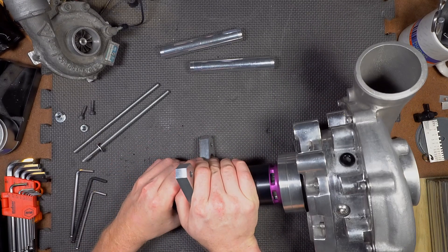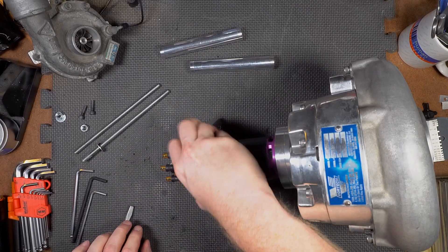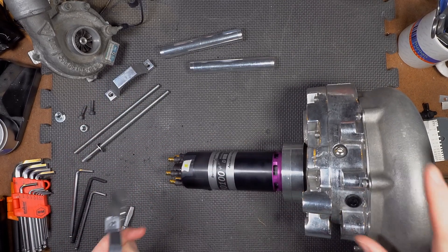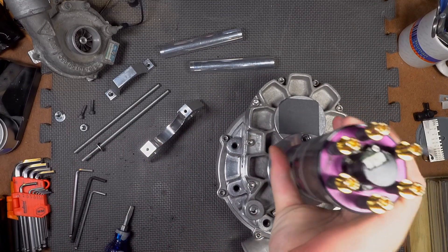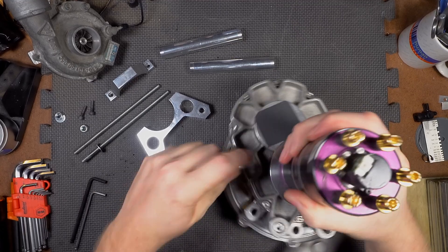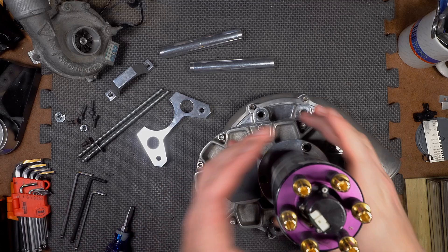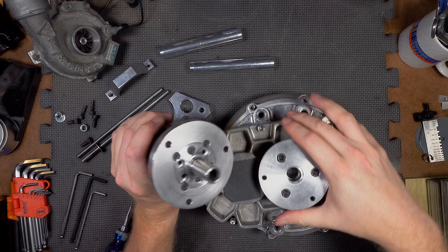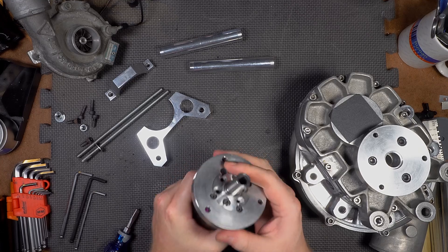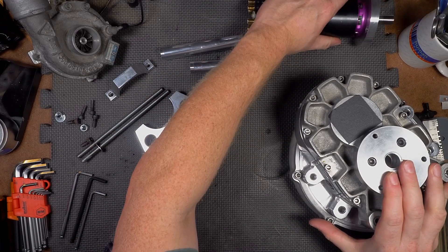This is kind of interesting because I have not taken this thing apart before. So that was a little bit harder than I expected. Now we're going to take off the motor — that's pretty easy, just three 6-millimeter socket head screws. Now we can lift out the motor and take a look at our coupling. Everything looks quite nice. This is very minimal clearance around the edge, but still perfect — it's not even loose.